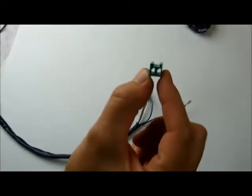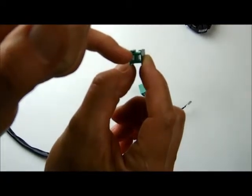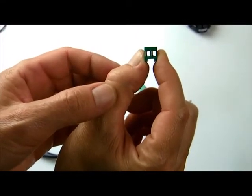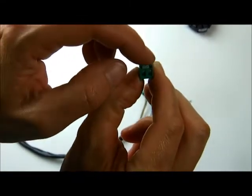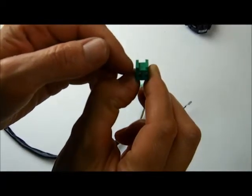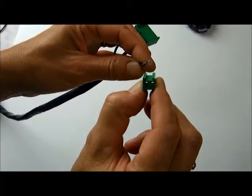Here we're going to learn which side the pin goes into the connector. I'm showing the side with the big slot on top, and also the tiny slot inside the connector. If you turn the connector 180 degrees, they look identical. The wire will actually go in this way, but we need to make sure that when the big slot is on top and the tiny slot is on top, the pin goes in the left channel.